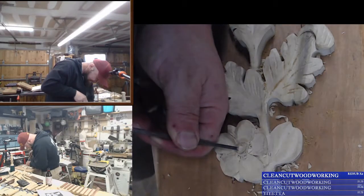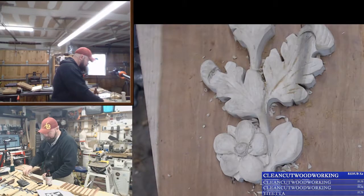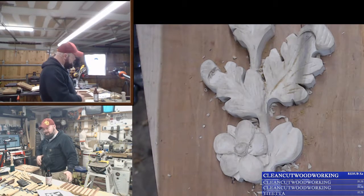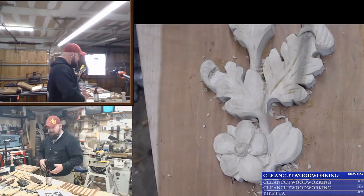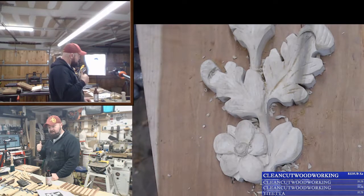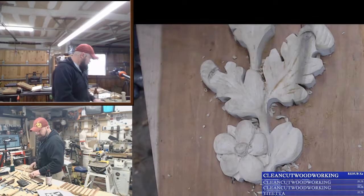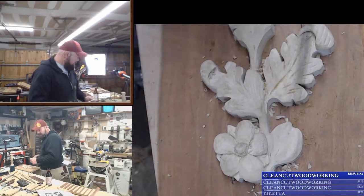So this one actually lost all its power, and so I got a new one, and it's sharpening square. But some of my tools are high-speed steel, some of them are A2 tool steel, and there's a huge difference in sharpening them. So I got a 200 grit blade for the grinder, and it is for high-speed steel, but you can sharpen anything else on there. But even though it says made for high-speed steel, it clogs up, and you've got to resurface it. And they're expensive, so screw it, I'm not buying any more of this. Let that one wear down.